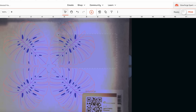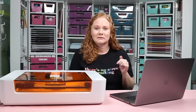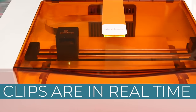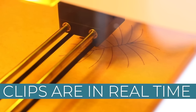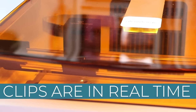I cancel the print and erase all coasters except for one — so now I'm making one coaster, one cut, one engrave, one score. Running through the process again, this single coaster will take approximately 21 and a half minutes to cut, engrave, and score. I'm okay with that, so I press the flashing button to get it started. You hear the air filter and everything start up, and the machine begins to operate.